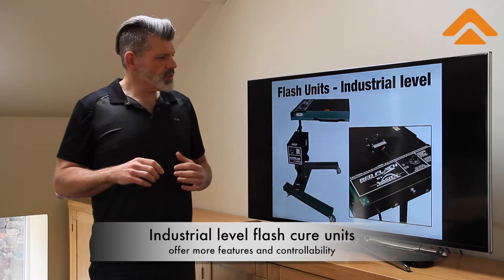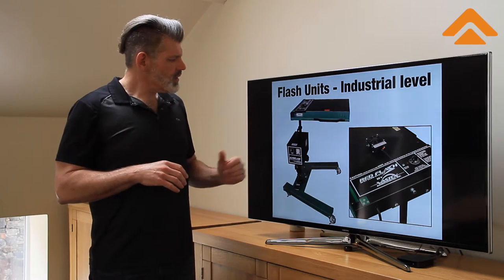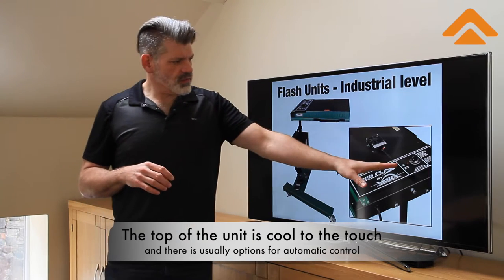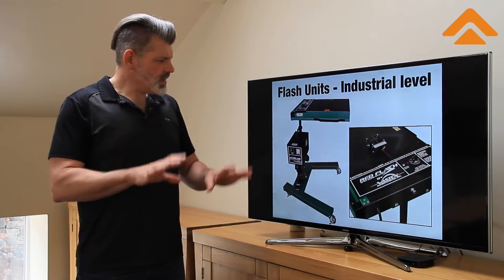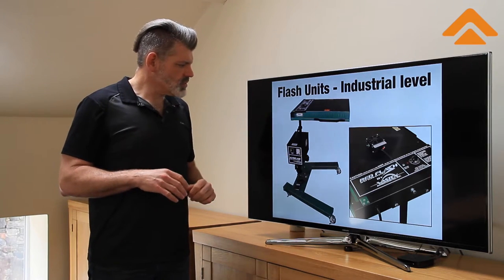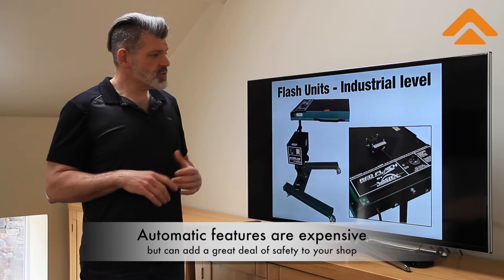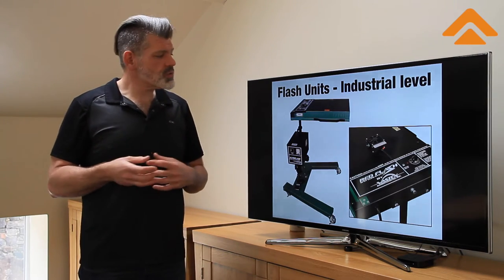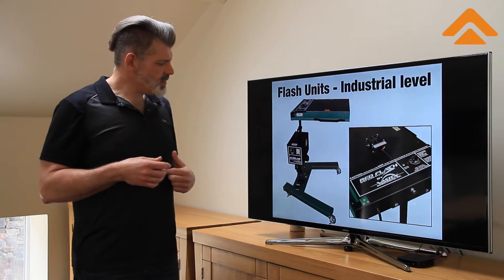This is the industrial level — still purely manual screen printing. This one has a foot-activated pedal that automatically moves the unit in and out, and on top you have heat controls, LED indicators for power and on/off status, adjustability for side-to-side and up-and-down positioning, and my favorite feature: a foot-activated timed flash that lets you move in and out and adjust the time as you go. This prevents you from burning your pallets or starting shirts on fire. Safety with flashes is a real concern — they are quite hot and open, and most shop fires I've encountered in my career revolve around the use of a flash. The automatic flash unit actually prevents this from happening.